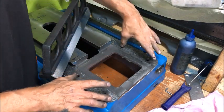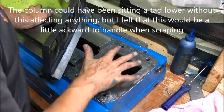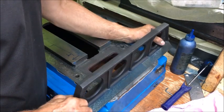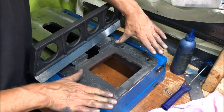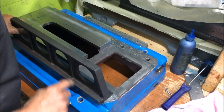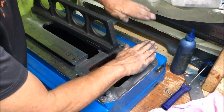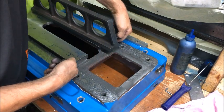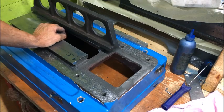Since this area here is open, and although these could have been dealt with separately from the ways themselves, I wanted to have them in the same plane. That could then function as a bridge across — using a straight edge that fits like two or three times the width of this — as a means to establish a plane, that they are co-planar, and also use them for these ways over here. First establishing a flat this way, and then both ways, so that I get the pin measurement here equal, and then start spotting. That has taken considerable time to get right.